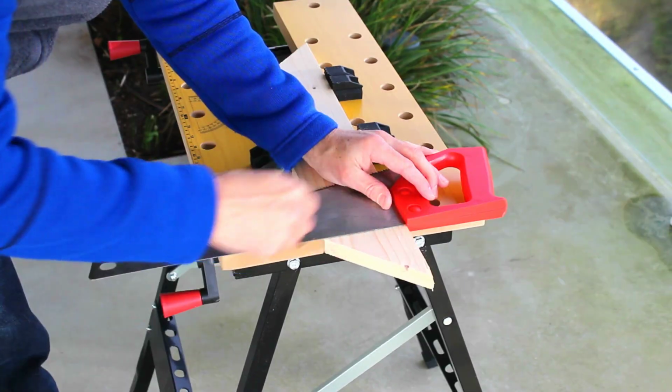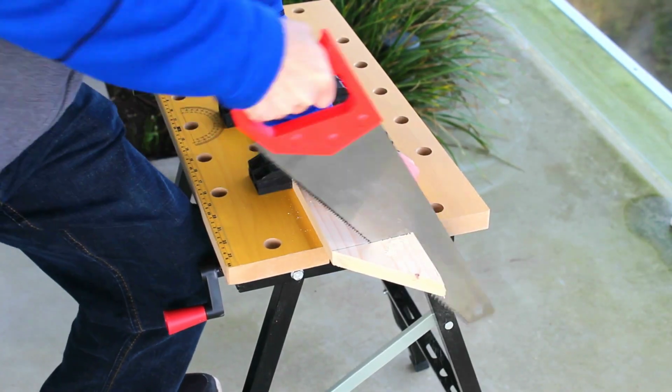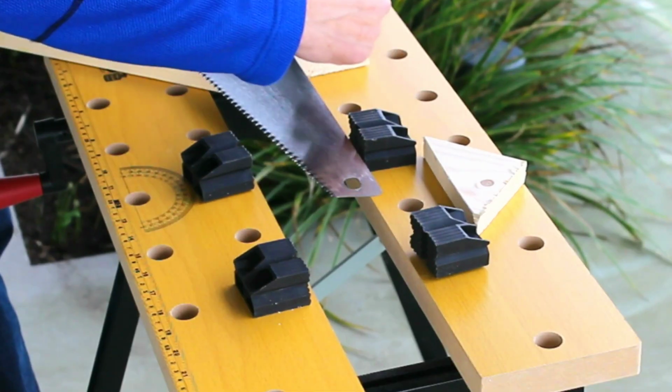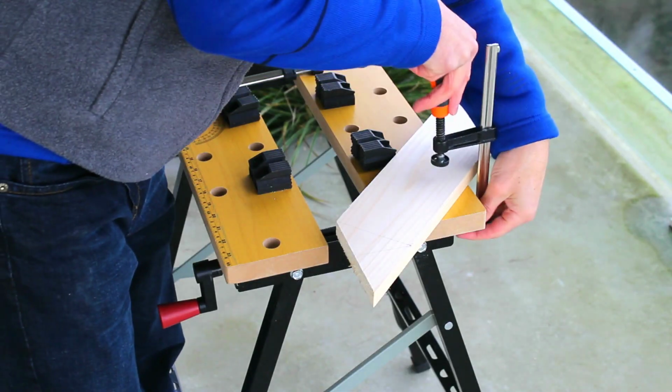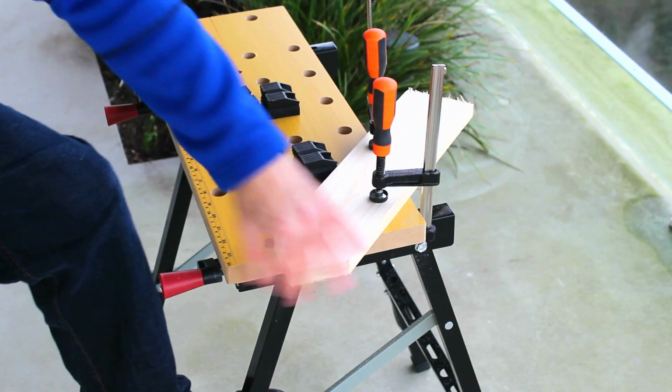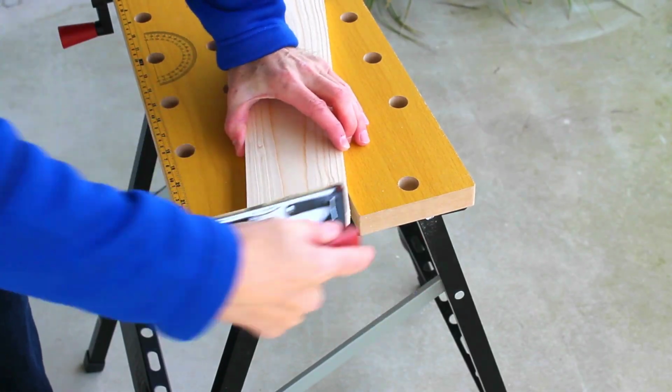For 2 of the pieces, I'll need to square off one end. The other ends already have 45-degree cuts, so I'll cut these at opposite 45-degree angles from the middle to get pointed ends. These pointed ends will form the top gable of the tower. I'll quickly sand these boards down.